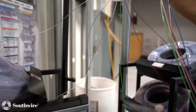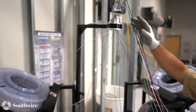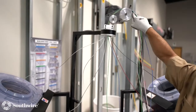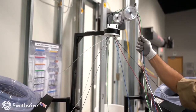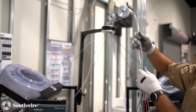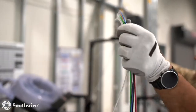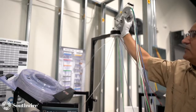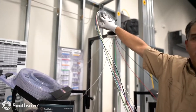The one reason we do the roller on this, as I saw on the barrel, is I'm pulling down. This roller gives me a nice arc, so it makes my cable transition a lot smoother, like going down in an underground pull. I can pull straight up, straight out, or I can go up, either or. And again, it follows me around the job, so it's going to turn whatever direction I'm pulling cable.